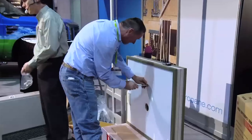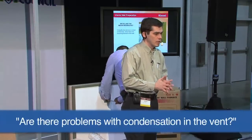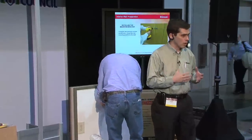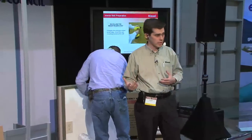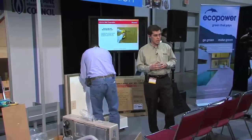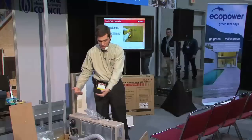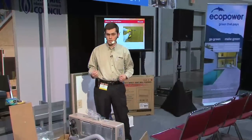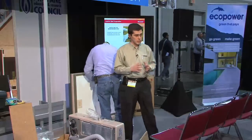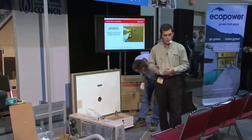There's no template for the electrical. You can put the electrical wherever you want if it already exists — you could use existing electrical. Just make sure you keep your code inspector happy. Some code inspectors would want that electrical on the outside, not totally behind the product. When you get this product totally assembled, there's not going to be access around the back without removing a plate, and some code inspectors would not like that. They would want the electrical to be available, and they would want the shutoff valve for the gas line to be available. So I've got it on the outside on this one — in case our code inspector wants a means of disconnection in that fashion.